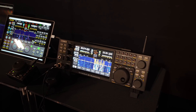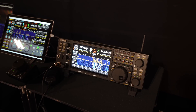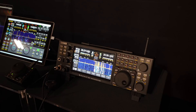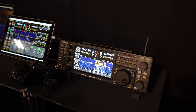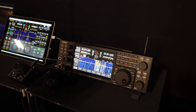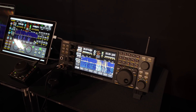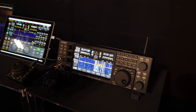You get three and a half hours off of a 10,000 milliamp-hour power pack USB. I got a 20,000 one from Anker — it doesn't double it because they spec it differently, at a different voltage. I got an extra hour with it. You don't double it. 10,000 milliamp-hour, you can run it for about three and a half hours. I ran it to actual exhaustion — I wanted to see when it would just turn off the radio.